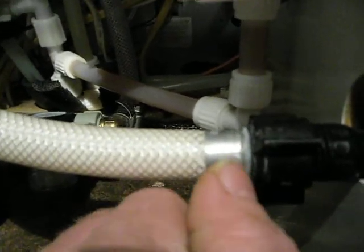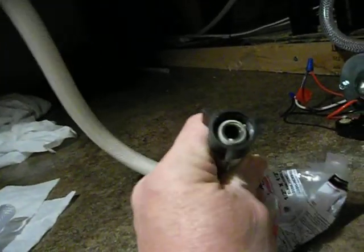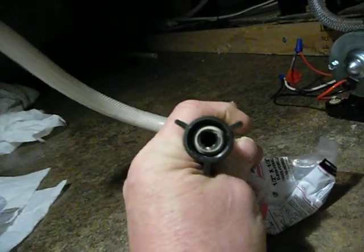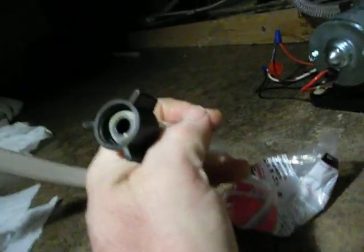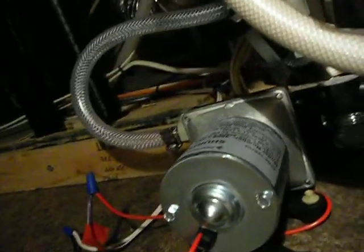You can see where that's kind of corroded. This is a factory hose too. Usually they say all you've got to do is replace the rubbers and you'll be good to go — which is false. I tried that, it leaked. I made PEX connections and it leaked too — well, the pump had a leak and I guess it froze.